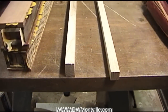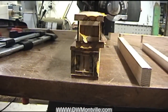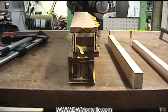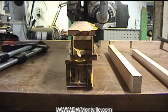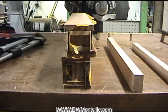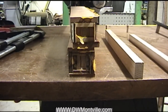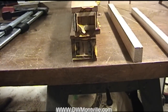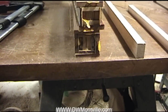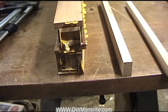The process of laminating the core is fairly easy to see if you look down the end — there are two of them here. The one on the bottom started with a more or less rectangular core; the one on the top is fairly square. You start sequencing out with laminations of various woods, fairly thin, that bring out the diameter more and more with each one. I tend to drive them out to about two and a quarter to two and a half inch square, then trim it down. Handles I won't make more than two inches at maximum diameter, but if you're using this for something like toothpick holders or salt and pepper grinders, you might want a larger diameter — just continue out until you reach the diameter you want.